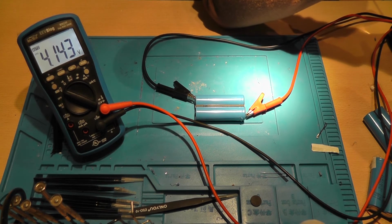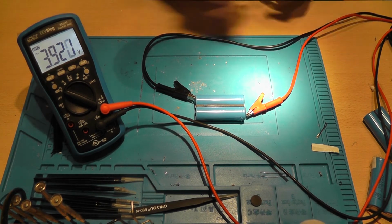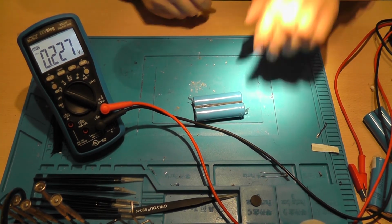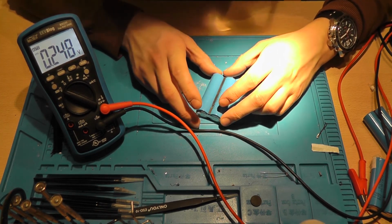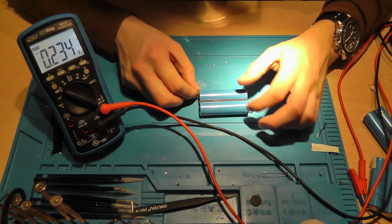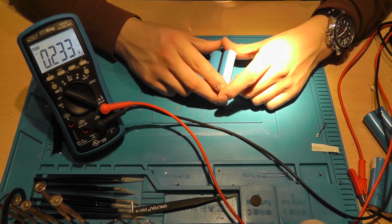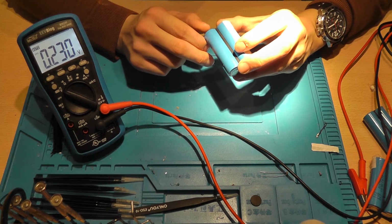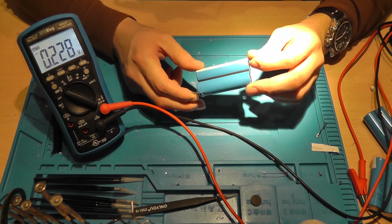So yeah, brief overview of my power supply. So again, like I said, you need to charge the batteries until they're at 4.2 volts. Then they're charged. This is a good way of doing it yourself, but there's one important catch. You need to keep an eye on the battery and the battery voltage. It's not like you just plug it in, turn on your power supply, and leave it until they charge, because that will damage the batteries, and it has the ability to blow up in or at your desk, and that's the thing you don't want.